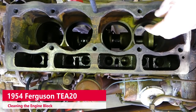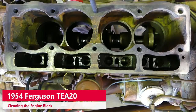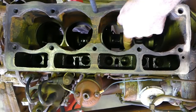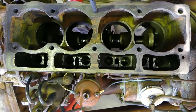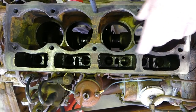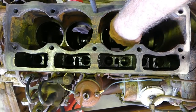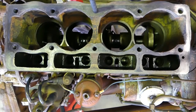In our series we've pulled the pistons and liners out and now we have the block. When I pulled the liners out it was all full of mud and rust, so I put a big pot underneath, got the pressure cleaner in, emptied it out every three or four inches, and pressure cleaned again with the journals taped up. The end journals are facing downward so I left those untaped.